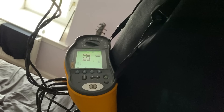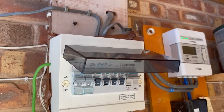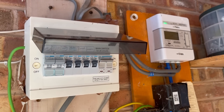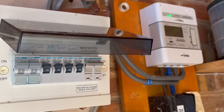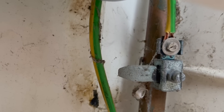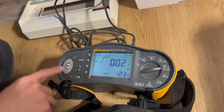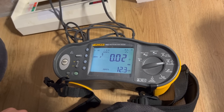There are a number of essential pre-checks that need to be made before commencement of the work. Primarily, it needs to be established that the rating and condition of any existing equipment, including that of the distributor, is safe and suitable enough to cope with the alteration of replacing the consumer unit. This means checking that the consumer meter tails are of an appropriate cross-sectional area for the type of system present, and that the earthing and bonding arrangements are suitable. For example, a measurement of external earth fault loop impedance (Ze) should be made if practical, to ensure that the installation is suitably earthed as per Regulation 8 of the Electricity at Work Regulations.